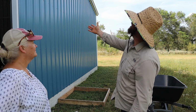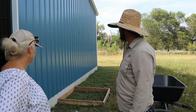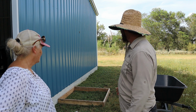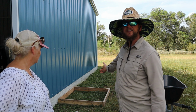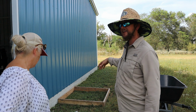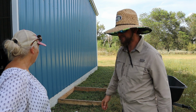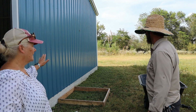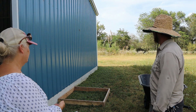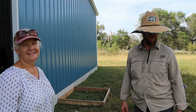We're going to use some of the extra paneling that we had from the shop and some hardware cloth and then some roofing to build it. So right now we are actually going to pour concrete and get that going, let the concrete dry, then we're going to start building the rest of the structure on top of it. And it's separate from the main building because if we ever want to move it, we can just bring the forks over here and pick that whole slab up and take it away. Yeah, exactly.